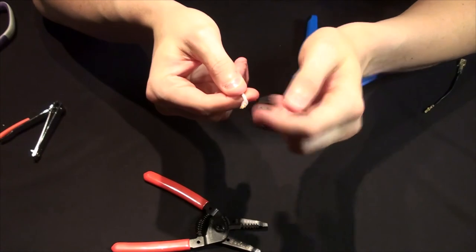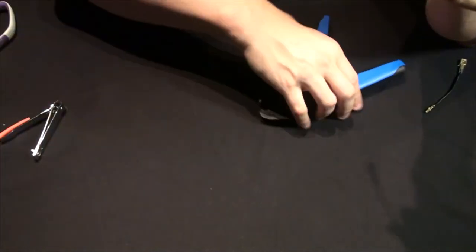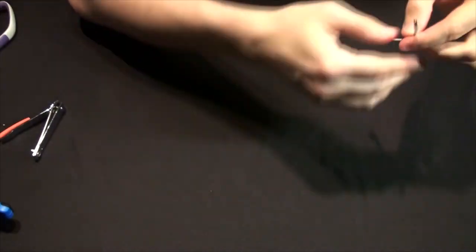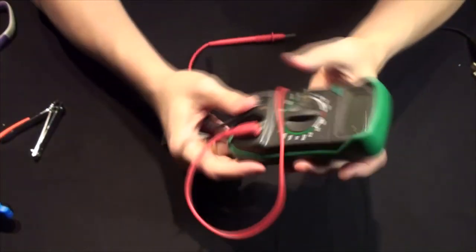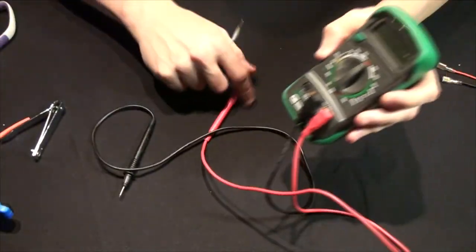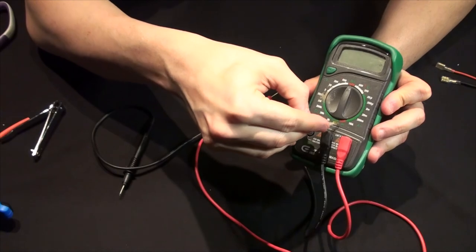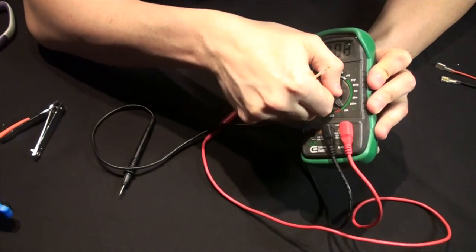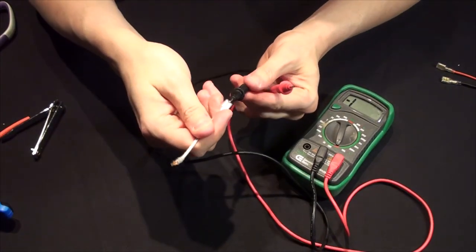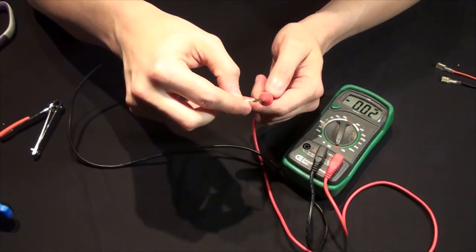With the male end, you need to connect it before sliding the cover up. Now that we've got our little converter cable made, let's make sure it's good by testing it with a multimeter. I've got a generic one — turn it to the continuity or diode setting, which looks like a little arrow into a stop. It doesn't really matter which end goes where. Plug one end in — right now it's reading around minus 0.2. Good, we have some current flow.